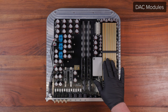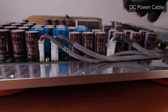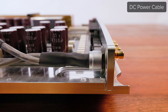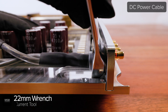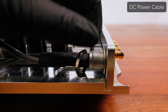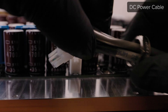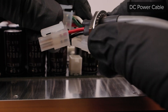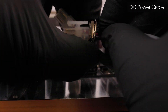Ensure each module is completely inserted into its connector and no modules are taller than the others. To remove the DC power cable, start by unplugging the three connectors by squeezing the tab on the side of each one and lifting them. Then use a 22mm wrench to loosen the nut and lock ring at the back of the connector. Once loose, move the nut and lock ring down the cable until you reach the section of exposed wiring just before each of the white connectors. Once they are all positioned, start passing the connectors through the ring one at a time, starting with the two-pin and then each of the four-pin connectors.